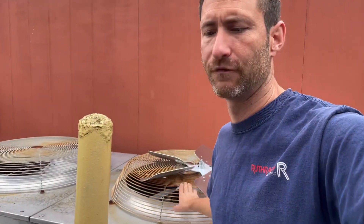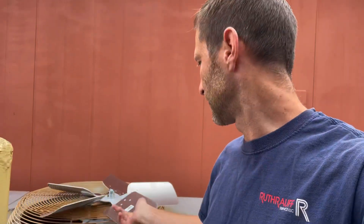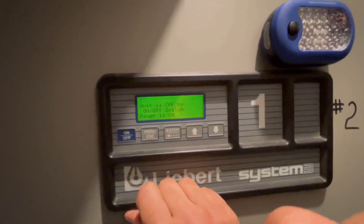Personally I think it's a bad design. The three-phase motors that are either on or off — I've changed maybe one or two in my entire career. It's typically these single-phase motors that fail. So I'm going to go inside, shut off the indoor air handler, then shut down the main power outside, and then extract the whole motor. Let's get started — go ahead and shut her down.